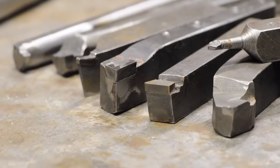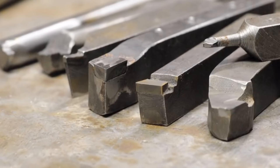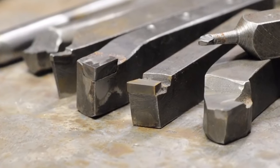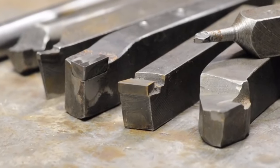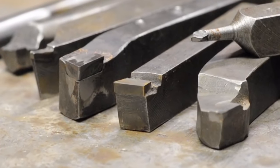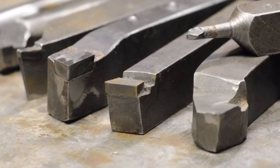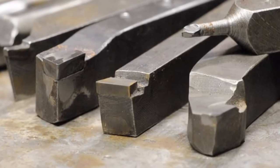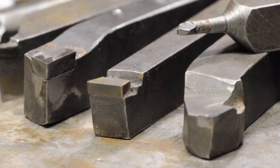After all that, if you do want to buy brazed carbide — and after all, it is cheaper than buying into insert tooling — get the good quality ones. They won't be as cheap as the imports, but you're much more likely to have a better experience with them. Not to mention, the good ones are usually ground and ready to go. And when it does come time to sharpen them, it's exactly the same geometry as we talked about in the high-speed steel video — clearance angles, relief, nose radii. Grind them to suit the job you want them to do.